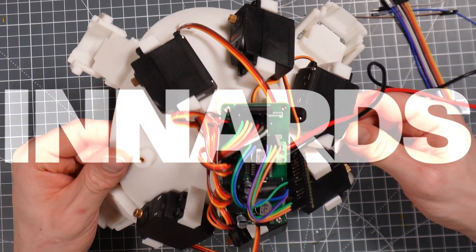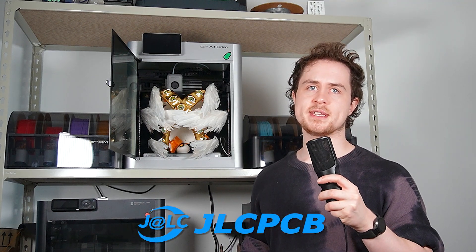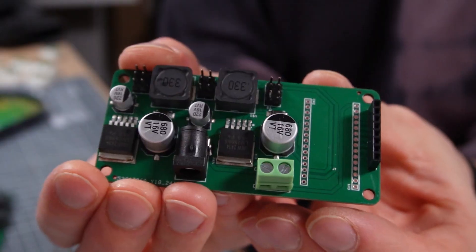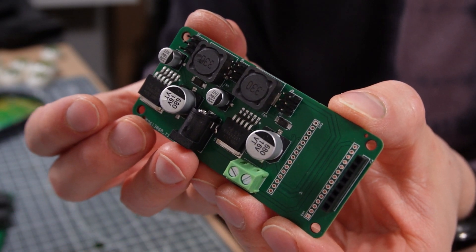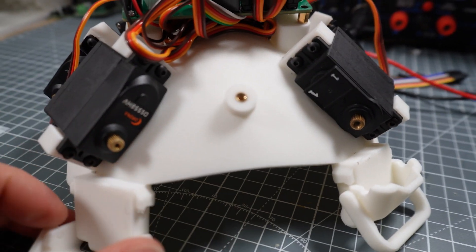When I worked on the first few projects with Little Empress, I didn't know how to design PCBs at that time, so this time I wanted to have the power circuit and Arduino on a single board, because it makes troubleshooting so much easier when you're not trying to deal with a rat's nest of cables. I'm partnered with JLCPCB, who generously provide me with printed and assembled boards, and I use their tool EasyEDA to make my designs. What this printed circuit board does is serve as an interface point to connect my Arduino — the microcontroller which tells the motors what to do — to the motors themselves, and also make it so I only have to provide a single 12V input, with the power supply to the servos running at 6V and the Arduino's logic running at 5V.